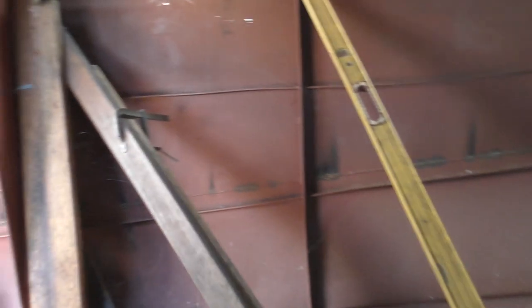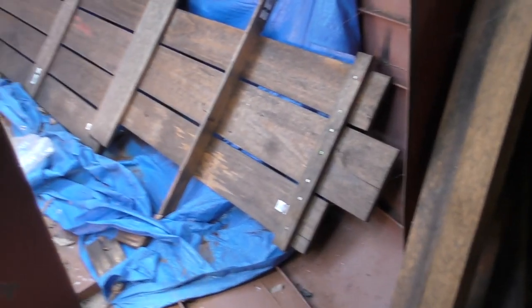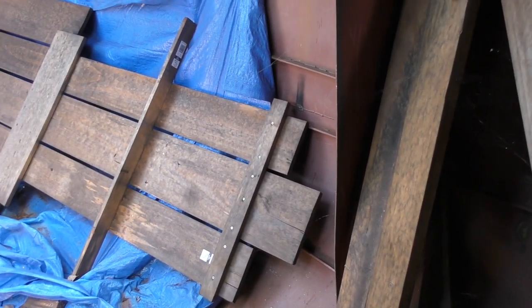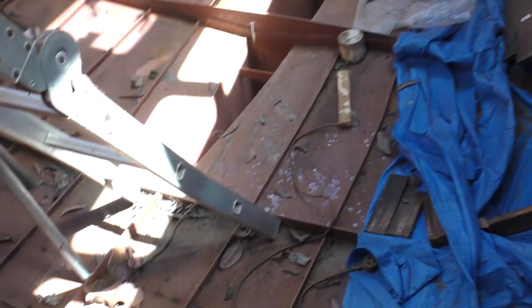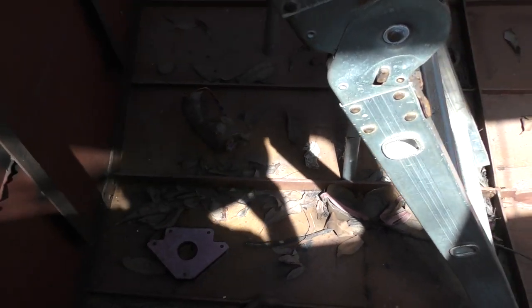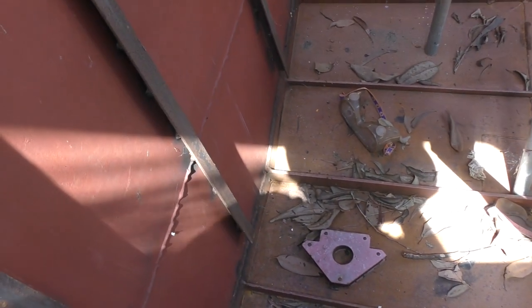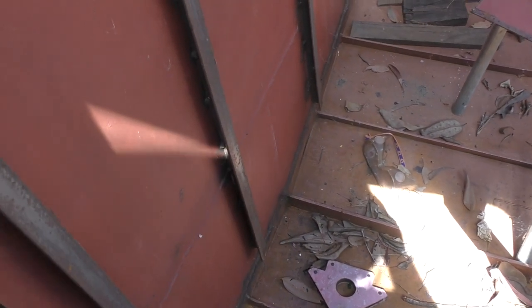This is the rear berth. And again, it's quite a roomy berth. It's very large. I've got to finish off shaping the cutout there and putting the doorway in. That's not too bad. There's not too much work there. Once that's done, next thing is right here, where you can see the bottom of the ladder and along that profile bar there. That's where the engine bed's going to go, and the prop shaft will go down through there. I think the engine bed comes from around that bay there and across to here, and the prop tube goes down through that profile bar, almost right where the profile bar meets the bulkhead that goes through there. So there's a bit of cutting out to do there.